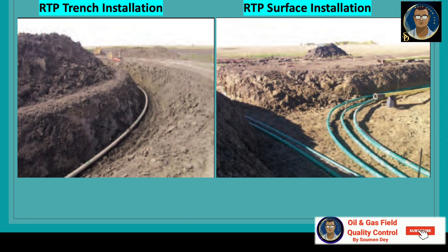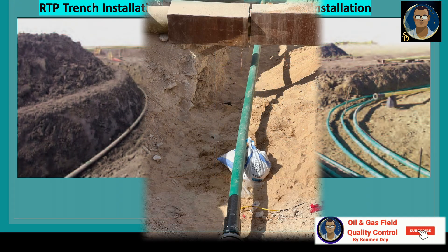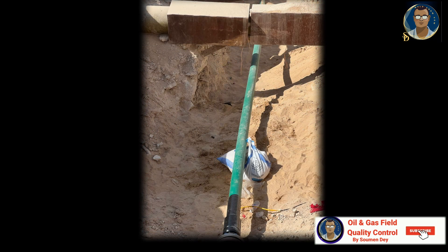The pipe may be inspected before testing or covering to ensure there are no sharp surfaces such as large rocks or contacts with other pipes. At pipe crossings, the RTP should preferably be passed under other pipes, and good padding or sandbags should be placed between the two lines. Direct contact, even after settlement, can result in rapid wear even from minor movement such as field movement or vibration.